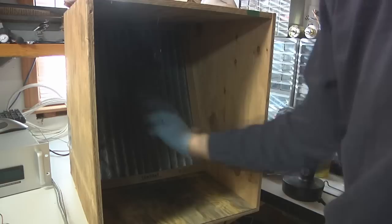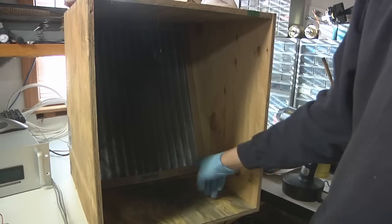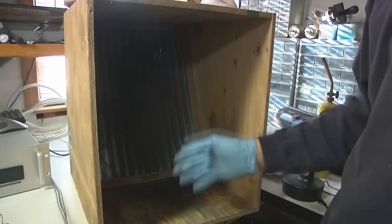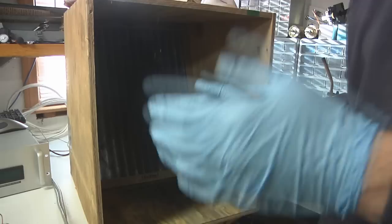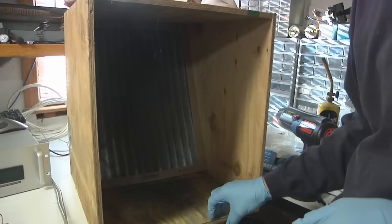It's not perfect. My initial investigation said that the powder particles were supposed to be quite large as far as filters go. I think I read 50 microns. So I got one of the lowest grade filters I could find because they were cheap. They were $2 or $3. I'm still getting a little bit of very fine powder out of the back of this thing. So I think I'm going to need to either step up and get a better filter or vent this out someplace else. Powder coating powder is, depending on who you talk to, not the most toxic thing in the world. If you read the MSDS, you'll never want to go near the stuff. So I think the reality is probably somewhere in the middle. I don't like to be around it too much, and I don't like to breathe it. But, you know, this gets me some of the way there. I need to make some improvements to it so that I'm not now breathing the fine powder instead of just the coarse stuff that the filter catches.